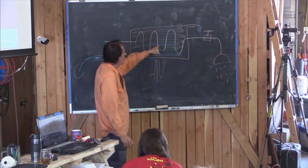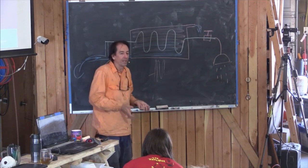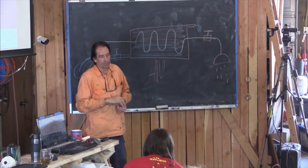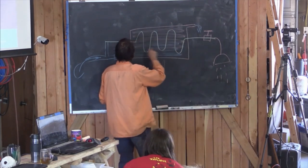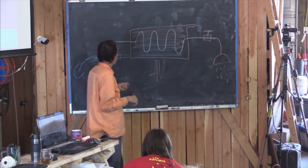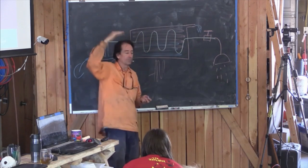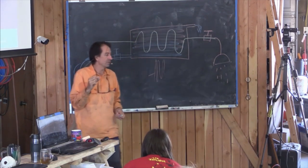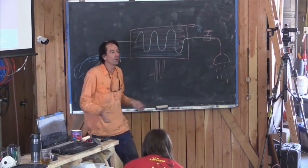With any pressure in this copper pipe at all, you always have a higher boiling point than the water in the tank. There's physically no way you can make it happen. We can have this water boiling away and the water in the coil will not be above its boiling point, so it cannot boil. If we open the tap and have flow through there, we're only dropping down to roughly the same atmospheric pressure, so the water doesn't have time to boil because it's not sitting there. When we shut the tap, the pressure goes up and raises the boiling point of the water in the coil anyway. The transfer of heat through the copper to the water in the coil is always a little bit inefficient. So the water in the coil, while it's flowing, can never match the temperature of the water in the tank. So there's literally no way that it can go boom.